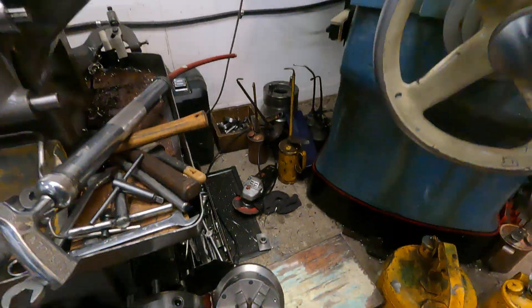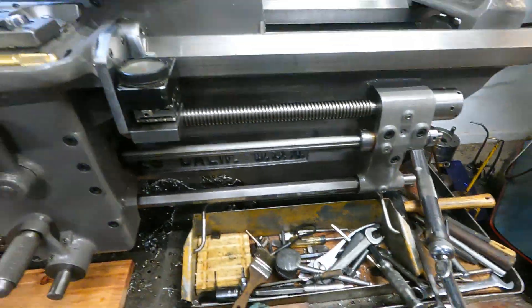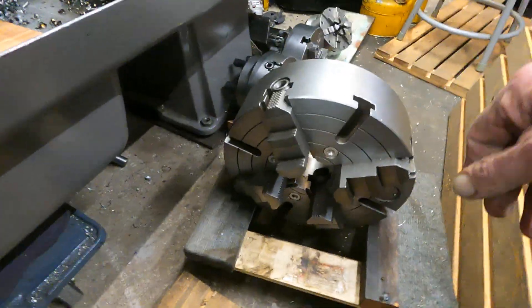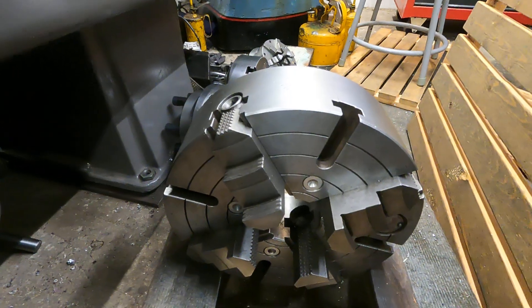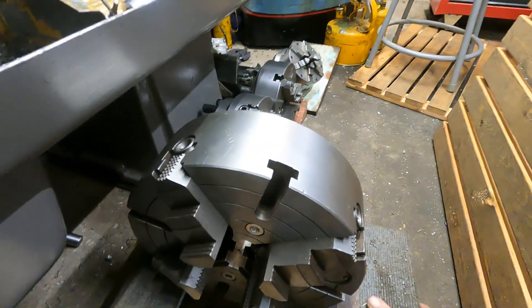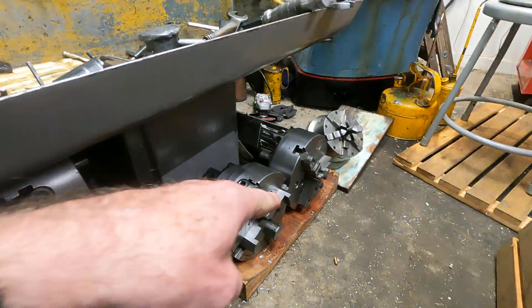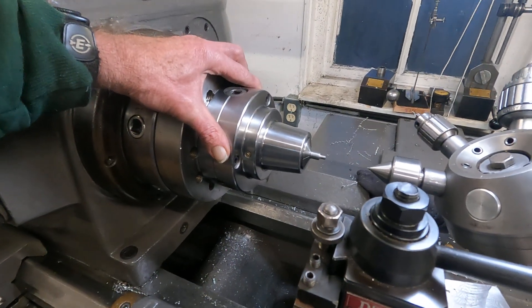For chucks on this thing, I've got a six-inch six-jaw, an eight-inch three-jaw, and an eight-inch four-jaw. I really like this chuck — it's probably my all-time favorite chuck. It's a solid steel Cushman four-jaw. Under there I've got a 12-inch Bison forged steel chuck with a four-inch hole, just in case I have to run into the heavy stuff — very nice for castings. And I've got an eight-inch Cushman. On here right now I have one of those Bostar collet chucks, and it's great.